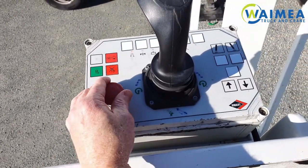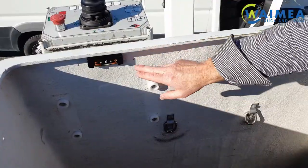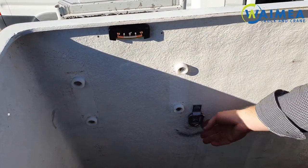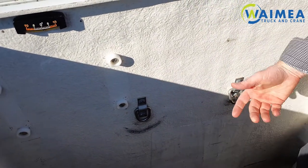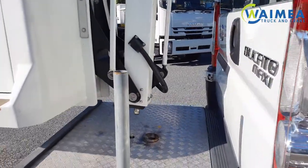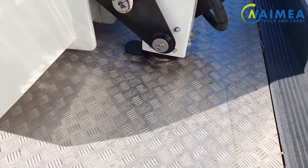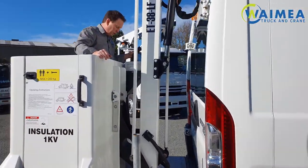Make sure the emergency stop is released and you're good to go. Inside the bucket we have an inclinometer, which indicates the safe working range of the boom. We have two harness latch points, should you have two operators in the bucket. When lowering the boom into its stow point, it's very important that it's completely homed — as it engages, keep pressure on the downwards function of the boom until it's completely stowed.